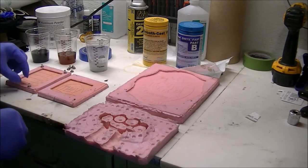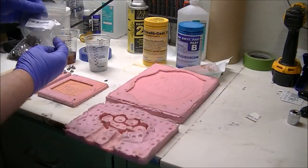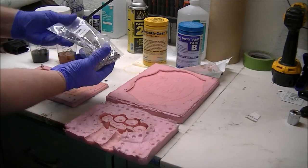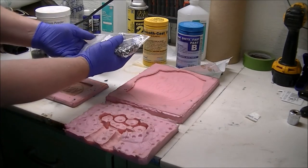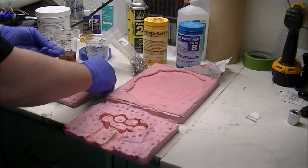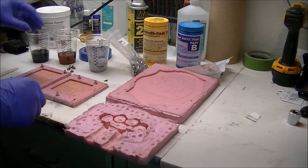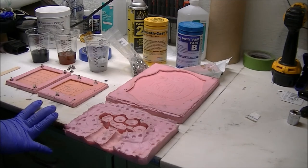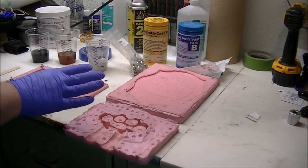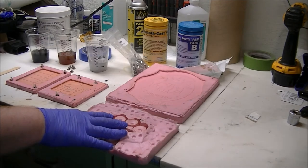The way I make these is that they have Chicago screws embedded in them, and the only way to do that is in the casting process. So I have these ones set up right here — I'll grab the female end and set them around the mold so they're ready to go in. I've got my mold set and invested with mold release. I have other molds here because if I have too much plastic, if I've over-measured, then I have somewhere for it to go.